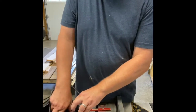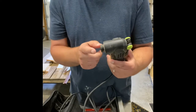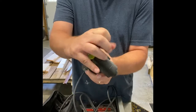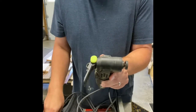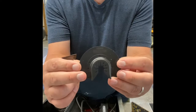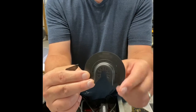A unique tool we're using today is an oscillating tool. If you've never seen one before, they are unique. This one has a method of quickly changing out your blades or sanding device. You flip up the lever and simply twist it open to swap blades. Here are some different blades I use with it. This is a standard saw blade — it's round and you can cut more surface area. All these blades are made to cut wood, plastics, and softer materials. They won't cut hard metals.